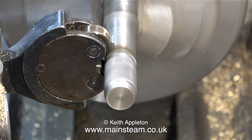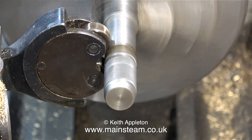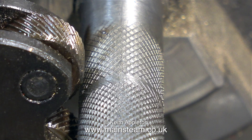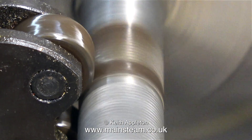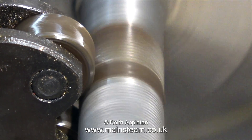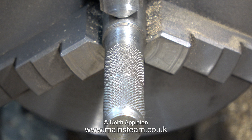Here it is on a piece of steel. Normally I would machine the piece of steel to make it concentric with the chuck jaws — it doesn't really matter though, because the tool compensates. Look at the quality of this knurl; it's different to the other one, it's not as spiky. I could have made this knurl a lot deeper by doing multi passes and winding in the tool before every pass. After another pass it looks like this — slightly different to the first one, but if I carried on they would both look the same.